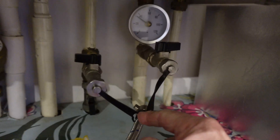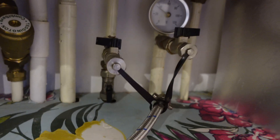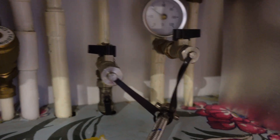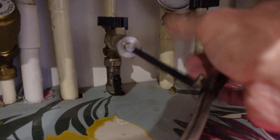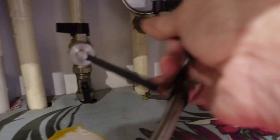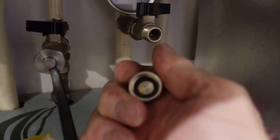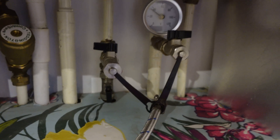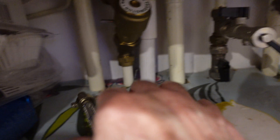Leave the loop in there, leave the caps on, and now you're quite safe. It doesn't matter if these get knocked on — you'll be fine. Make sure there are rubber washers in the caps; they normally come with them. As you can see, there's the rubber washer in there. Give it a little nudge with a pair of grips or a small spanner so they're nice and tight — and that's it, until you need refilling, when you reconnect the filling loop again to get to the right pressure.